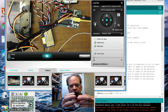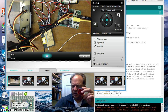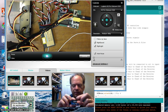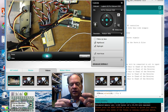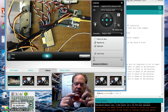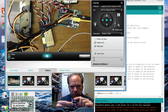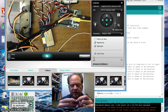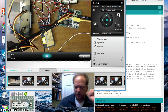I'm also going to try these things — they're nice and remarkably affordable. This will hold two DC motors. You can buy these in huge amperage; I think this is like a 20 amp. This one is only 2 amps per motor. Nice thing about it is it's very affordable — you can get these for less than $10. The downside is we're going to have to actually teach it how to behave. It takes a minimum of four wires to run two motors, and preferably six to change speed. You can pulse the enables — usually you pulse the enable to turn it on and off to give it variable speed.